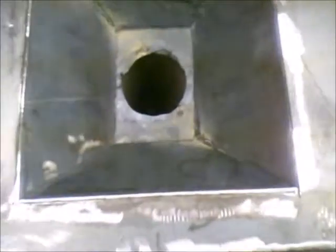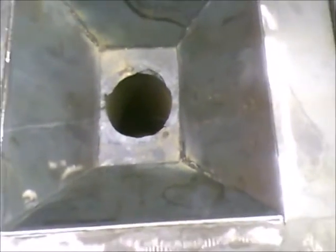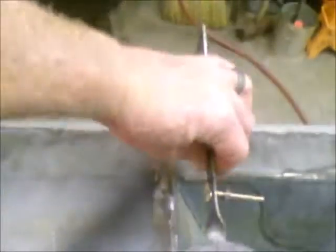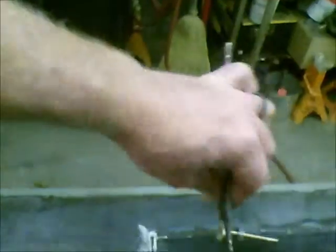Okay, this is on to day two of the forge build. I've got the plates all tacked together and most of the final welding on the back side done. That's a three-and-a-half inch pipe coming up from underneath, with a three-inch pipe teed into the side of it — that'll be where the airflow goes in. Then on the bottom there is a flapper door. It gets bolted on and will have a spring that holds it tight, with a lever sticking out toward the front so I can take my foot, raise it up, and drop the clinkers down through. I also took a piece off of the same old barbecue to make a grate to sit in the bottom.